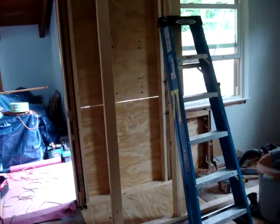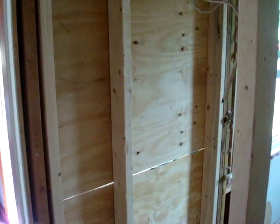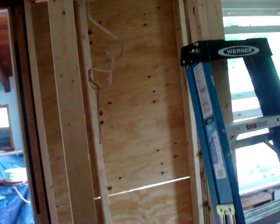We're in a 1979 modular home — typical light construction, made out of wood, which was pretty typical at the time. Two-by-fours on 16-inch centers all the way around the house. What happened here was the house suffered some water damage and two of the two-by-fours were compromised due to rot and decay.